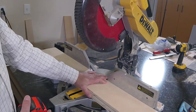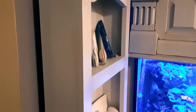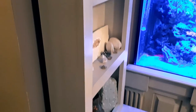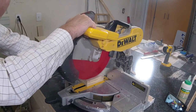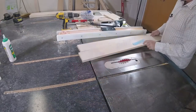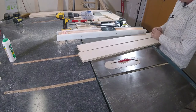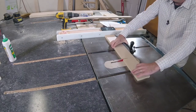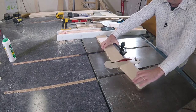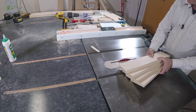These are going to be the sides of the shelf — they are 40 and one quarter inches long and five inches wide at finish length. Our cut sheet left us just a little bit long, so I'll mark and cut them to size. I also have two pieces labeled shelf, which are four and a quarter inches wide, and each shelf will be cut down to 16 and a half inches in length, giving me four shelves per unit.